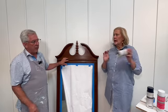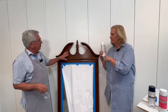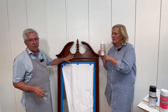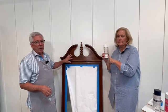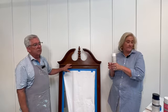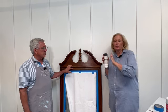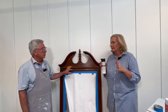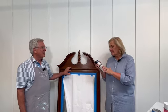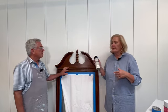So when do I use the primer? You want to use it if it's raw wood to seal the wood, or even if it's been stained and sealed with a top coat but it's grainy — because we want to fill that grain and get a smooth surface. We've used the primer as our grain filler. I chose the color: Belgian blue is one of the prettiest lacquers that we have. Blue is in right now — look at the colors we both have on. We love blue, and we love interiors with white, blue, and different values of gray and cream.